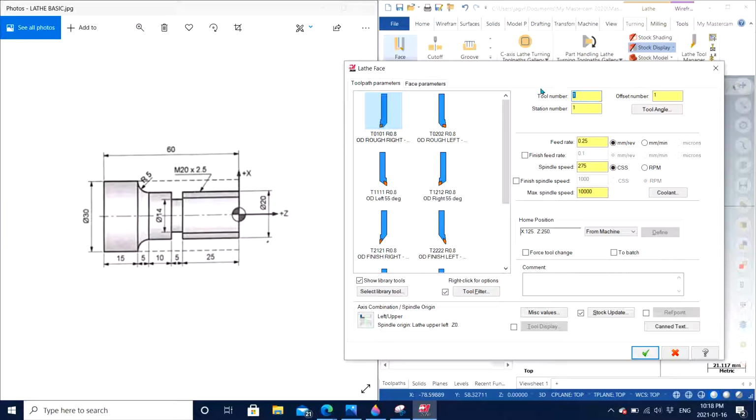So tool number is given with respect to a tool list, which is always provided in your workshop, because that specifies what exactly tool is present in the tool turret that you have inside the CNC machine, and allows you to make adjustment according to your tool list. That's why a specific machine will always have a tool list in which it will show you what particular tool is inserted in which turret column, so that it becomes easier for any CNC manufacturer plus the person who is going to design the G-code through Mastercam to understand and study which tool goes to which place, and according to that he or she doesn't make any mistake while making the program.